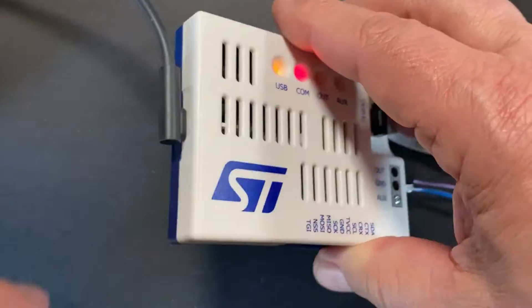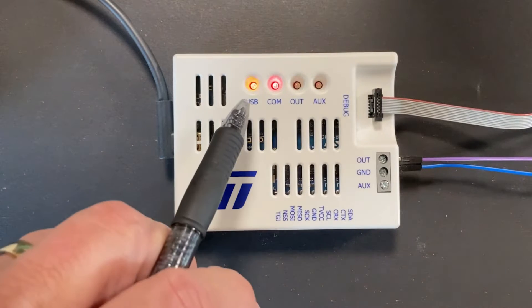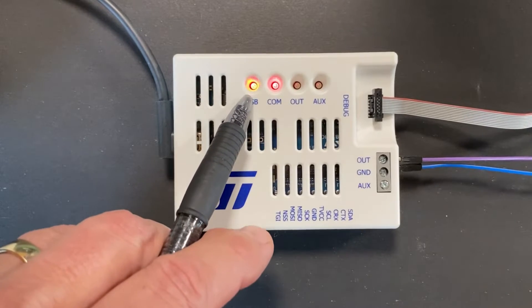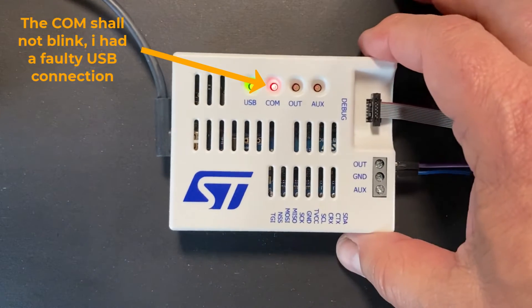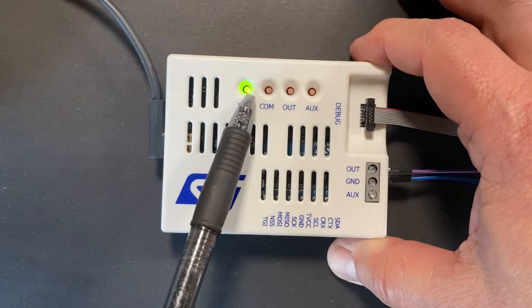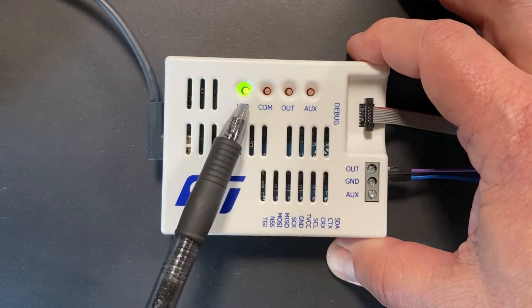It takes a normal USB-C interface. The USB connector LED may appear to blink due to the camera, but for the naked eye it's not blinking — it's yellow. You actually don't want that yellow; it depends on the port you've connected it to. I'll change to a powered USB port instead. Now we can see it's a green light, and that is really crucial for this device. You need green if you would like to use the power output and the current measurements, so make sure that one is green.